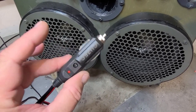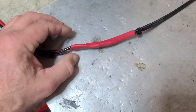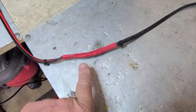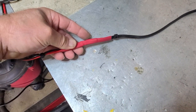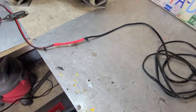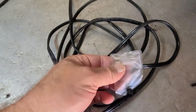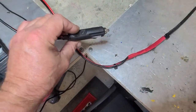It stays nice and solid. I just spliced it with heavy-duty industrial heat shrink and tie straps right there to hold everything good — nice and solid connection. These ferrules, offset ferrules, are offset but yeah, good to go, problem solved. It's got a fuse; these have got fuses in them which are right here, which I've reattached. So in case a fuse pops, just pop a new fuse in there.